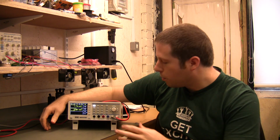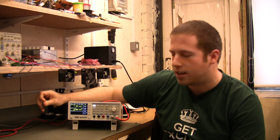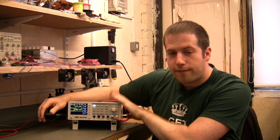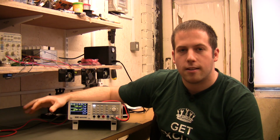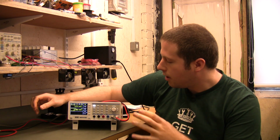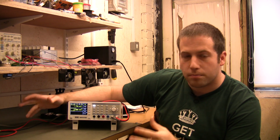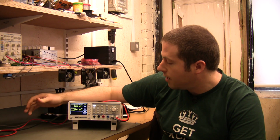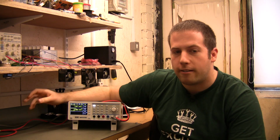So it's a 5 3/4 digit multimeter, so some of the competitors out there are pushing that a bit higher, 6.5 digits. What you do get, this is generally slightly lower cost than most of those. Also, the functionality on it is absolutely superb. In particular, things like using it as a DC power meter, being able to log the results, the statistics are all really, really nice. The firmware updates on this are great, and we've already had one through from Hameg. And yeah, there's some talk there about really making the most use of this large, gorgeous screen that has, so during use, under lighting conditions, and even at quite an odd angle I'm looking at now, is very, very clear.